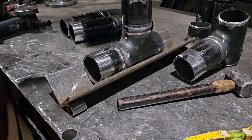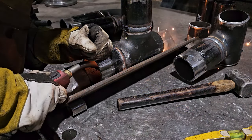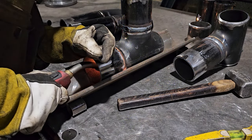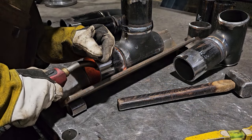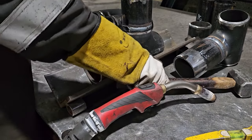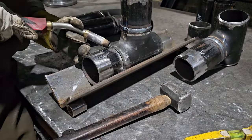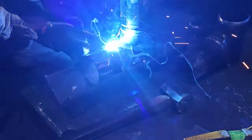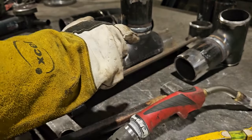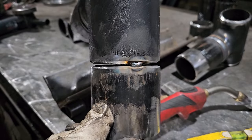I've been told you can tack on the inside of the pipe, and when I do, I'm able to melt the tack away. I find it easier because I can do the inside and then the outside. The reason I do the inside is because it's naturally going to shrink, and I can counter-react the shrinkage with a hammer to keep everything level. If I tack on the top, it's just going to shrink and pull the pipe upwards, making it skewed - which is undesirable and wastes time trying to straighten it after.